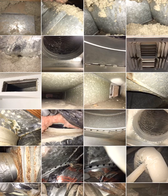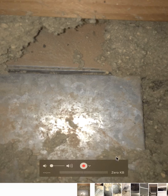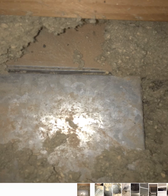This training is just regarding ducts. So we're going to go through these. This is a trunk line. This is a seam that has not been properly sealed, and air will leak through there. With trunk line pictures, sometimes you have to uncover some of the cellulose to get to the seams so you can get the picture.